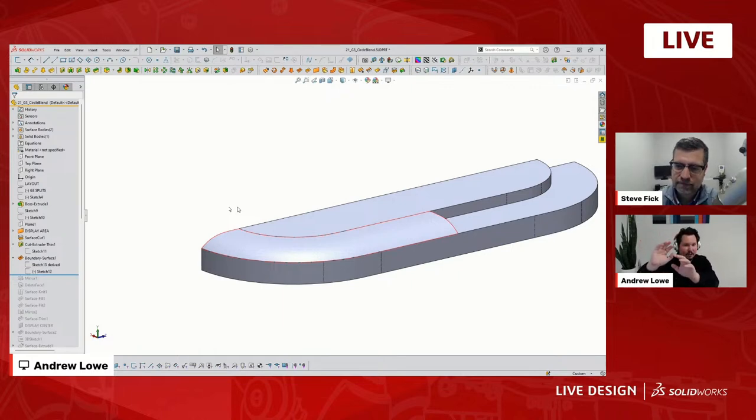The derived sketch was great for trying to line up those different shapes, where I took this cowl shape, this cowling, from one portion and moved it over here. I had to get different geometries to line up. I had to get the draft angles on the one part to also look right when you moved into another portion of the product, with a little lip for that thing to live on in different orientations. And derived sketch was a huge helper in being able to translate that geometry.